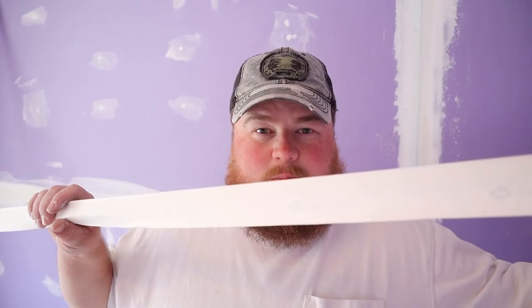So far it's going pretty good. We are doing our fourth inside corner right now. Angela's actually taken over and she's done the two on that side of the room. I think they look very, very good, so I'm happy to let her continue on that way. I've been applying the rest of the synthetic woven tape on all the joints, and we'll begin to mud those next here above the windows, and then also put up this outside corner bead up there as well.